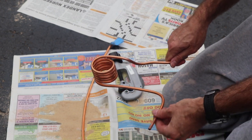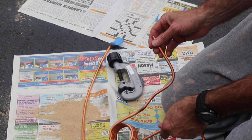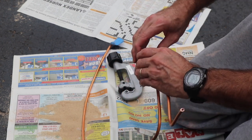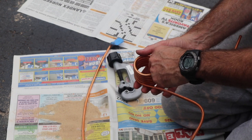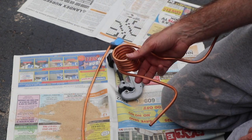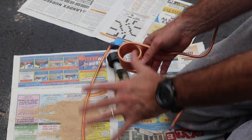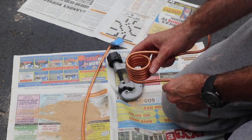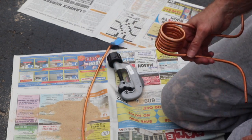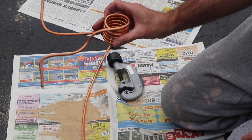Here's the finished coil. I'm going to hook up some tubing to these ends for running water cooling. I've got almost six turns — probably five and a half — which is good, and a nice tight coil. Remember, the tighter your coil is to your workpiece, the greater the transfer of the magnetic flux fields. The larger the diameter of your work coil, the bigger workpiece you can fit, but you're going to need more power to get the same energy transfer. This is good for most small things like heating and annealing.